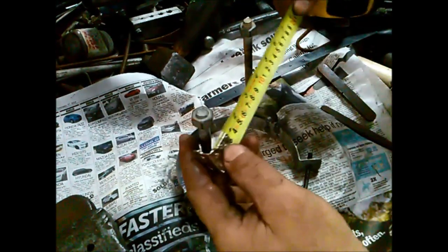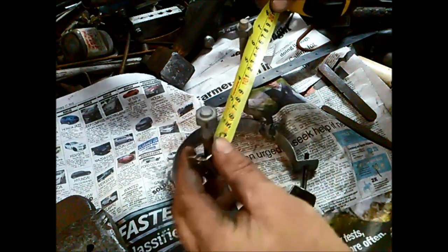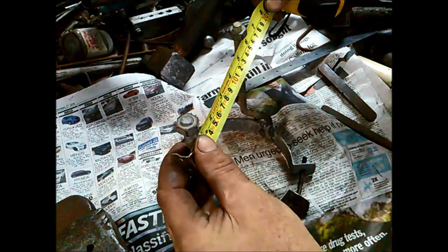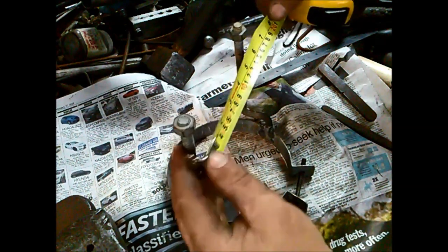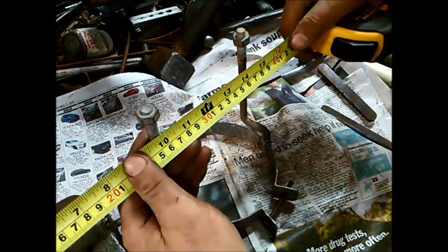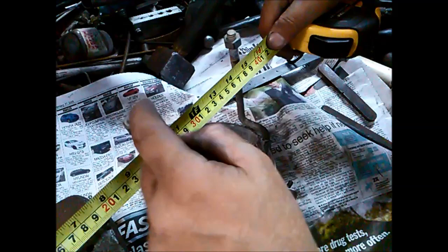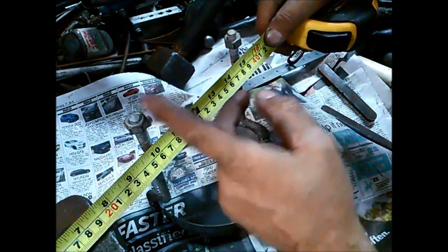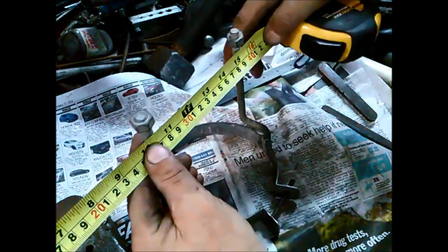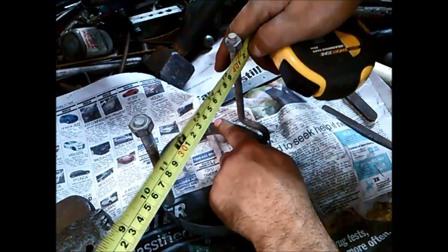Now for the plate. I'm going to need a plate that's about six and a half inches, with half an inch either side. You can see the centres are five inches apart, so I'm going to drill two 5/16 holes. I might need to actually slot them a little bit just so it pulls in — so this top edge is actually pulling into that step as I'm winding it in.